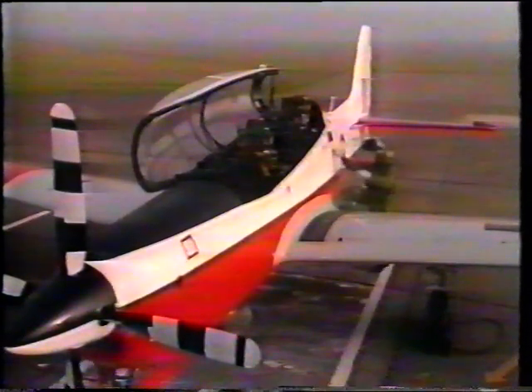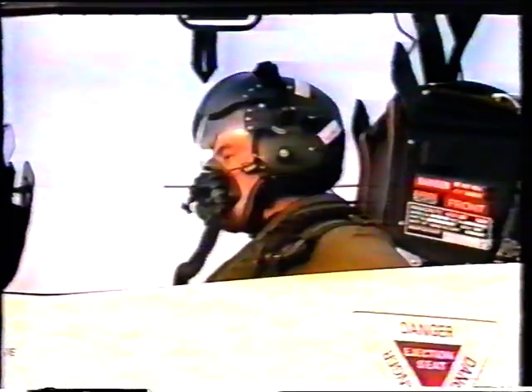We can look at one or two points about the seat while it's in the aircraft. Normal pre-flight checks are carried out and strapping in is perfectly straightforward, and better practiced on a training seat. That important — indeed vital — bit of kit, the firing handle, is in its usual place between your thighs on the front of the seat pan. Seat height is adjusted by this switch on the left hand side of the console.